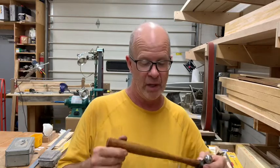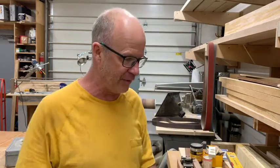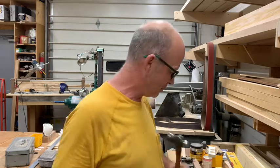I think you're going to like this next step on the handle — it's definitely worth a try to see if it's for you. I'm going to put it on some axes and see how it goes. Everybody has their own stuff: some people like Axe Wax, Killinger has his Snake Juice, and Micah with Hildrey Restorations has an oil mix. But I think this is really cool and it's old school. After your oil — whether that's boiled linseed oil, raw linseed oil, or tung oil (except don't use Watco tung oil) — when that's dry, get yourself some beeswax.